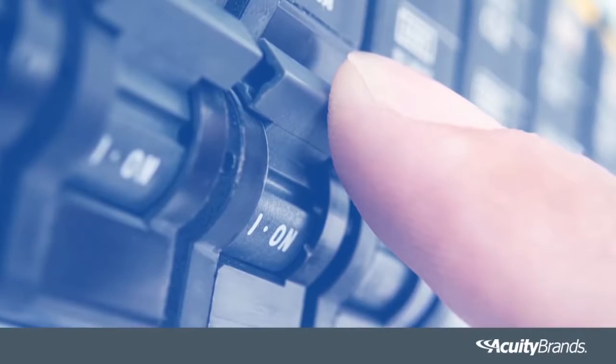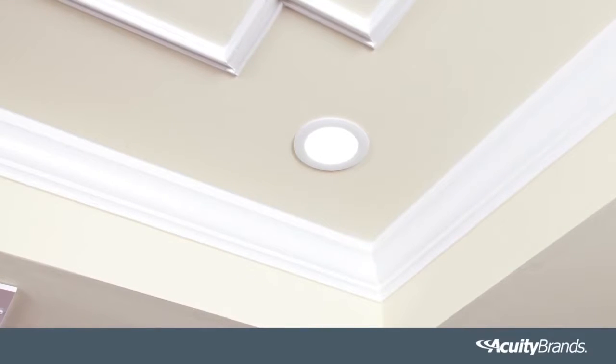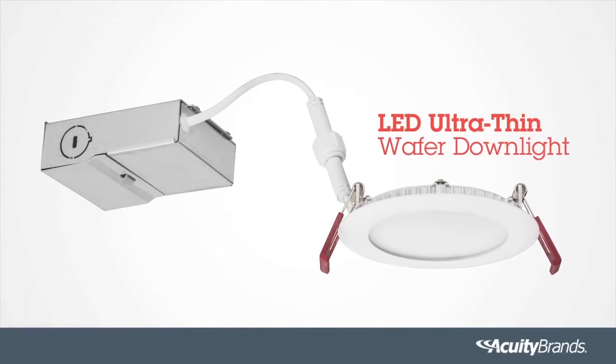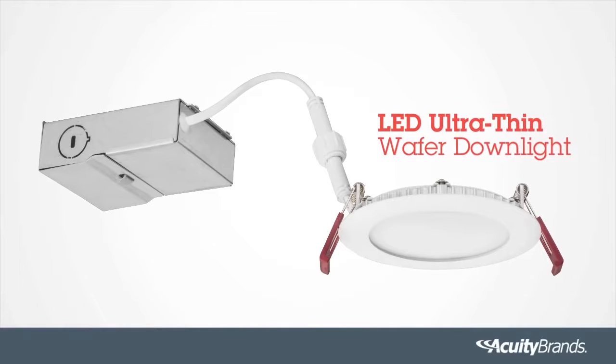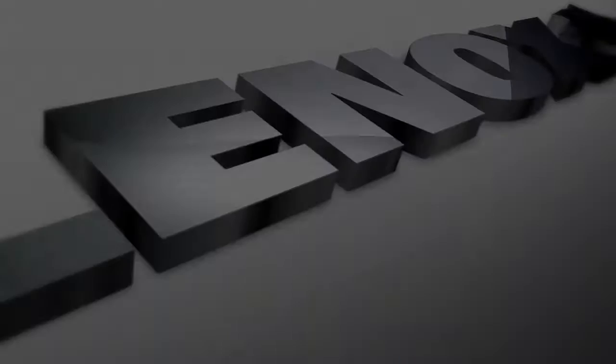Turn on the electricity at the circuit breaker box. Turn the power in the room back on and be sure the module illuminates. This completes the installation of the LED ultra-thin wafer downlight from Lithonia Lighting.